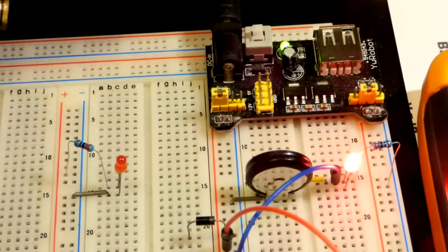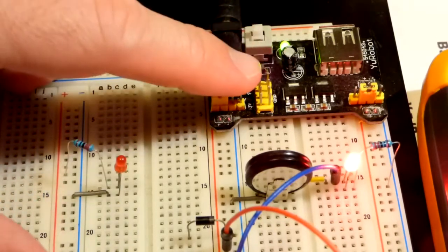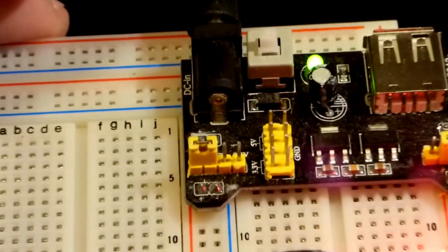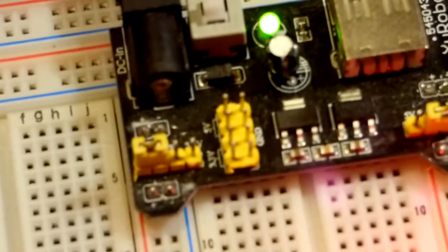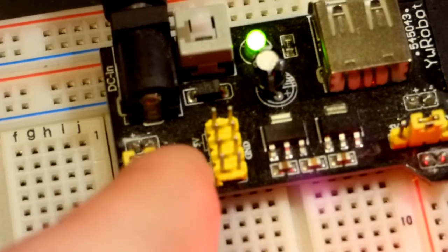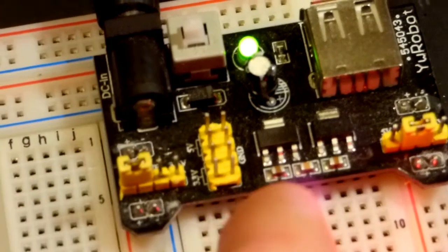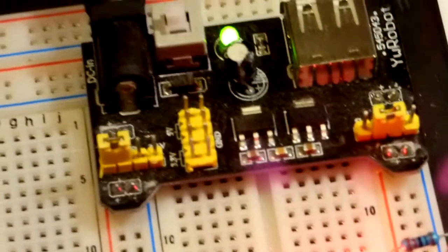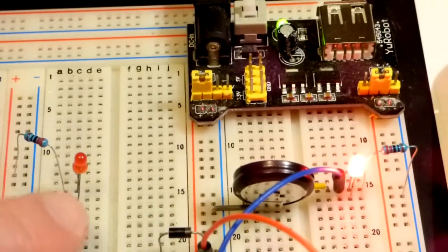In this video I'm looking at an interesting part of this power supply that I don't really use in many videos. Someone asked me about these pins, so now I'm finally getting to it. We've got eight pins right here in the middle - the front two on the left have 3.3 volts, the back ones say 5 volts, and all four pins to the right are ground pins. Connecting to one of these pins is just like connecting to one of the blue rails.